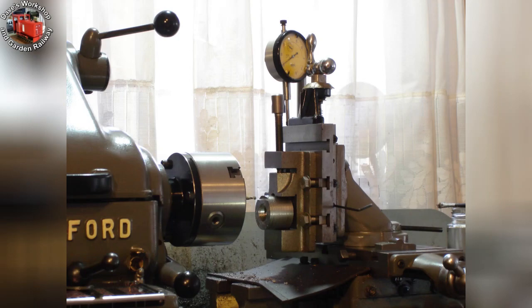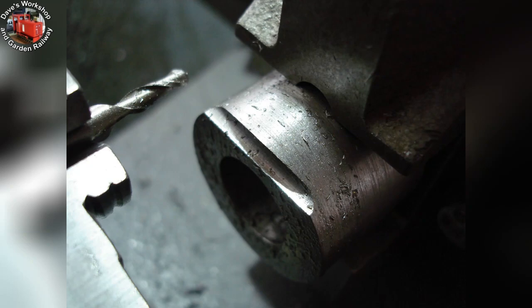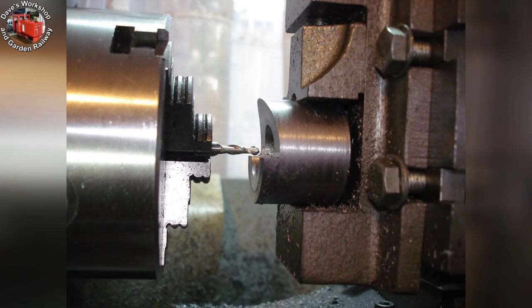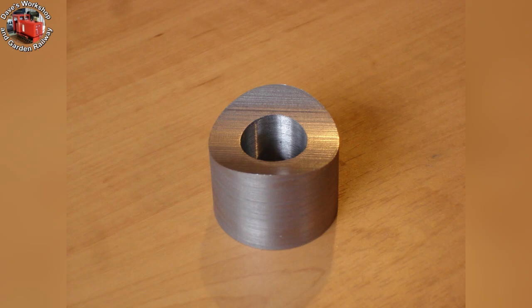Here's the setup, using a plunger clock to simplify the vertical slide readings. I'm now using Google Sheets to calculate the increments, and then tweak them so that they suit the lead screw dial markings. Quite a few cuts into the job, the curve was starting to be noticeable. Cutting to full depth in quarter-mil vertical increments. Halfway there, full depth at about 5.5mm. Those lovely curves — at the end of the first day. Finished on the machine. I do like this process and don't mind the time it takes.